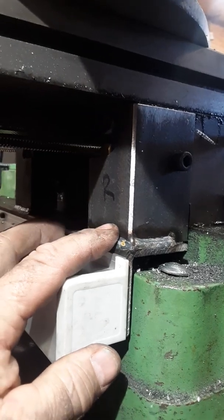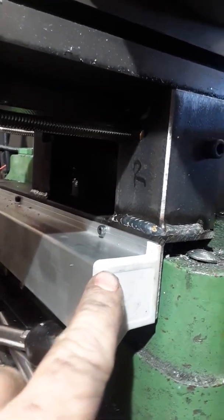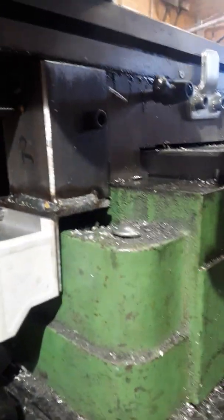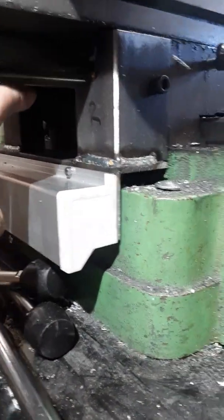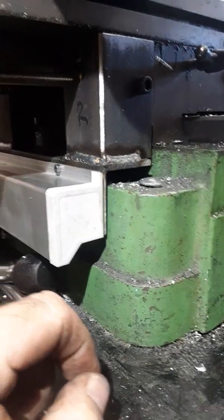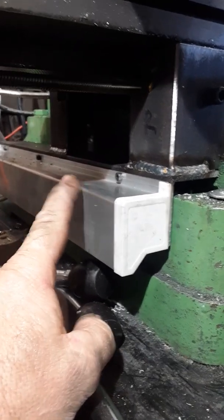The y-axis is located down here. Basically I took a couple pieces of angle iron and welded them here and here, welded to another piece of angle iron that the y-axis encoder is bolted to. The y-axis reader is bolted to the base, so when I move the table back and forth you can see the encoder is moving but the reader is stationary — that has proved to be very stable and works very well. I saw some guys bolting the encoder to the base with the reader on the moving piece — I didn't like that because I could see swarf getting into the encoder and causing problems. This little cover keeps everything covered up nicely and I've had zero issues in the three weeks I've been running it.